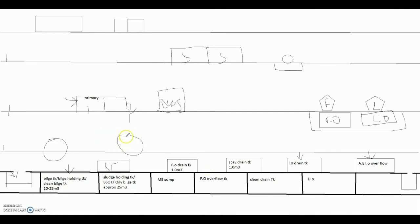The reason there are separate tanks — like scavenged drain tank, stuffing box tank — is so that if any sludge is rising you can identify from where it is coming. That's why they have made small tanks put separately. You can then transfer using the sludge pump to the waste oil tank — you will have one or two waste oil tanks — and then burn in your incinerator. Fuel oil pump trays and lube oil pump trays will go to fuel oil drain tank. Bilge pump tray and OWS tray will go to the bilge tank.